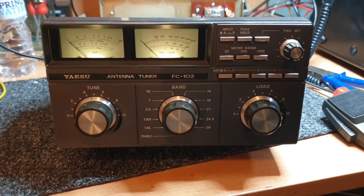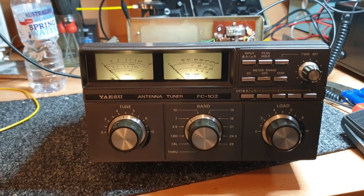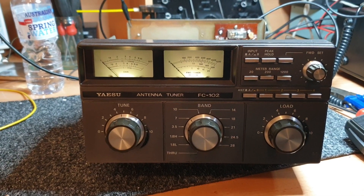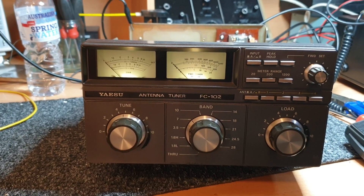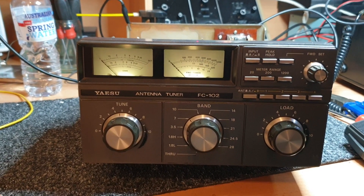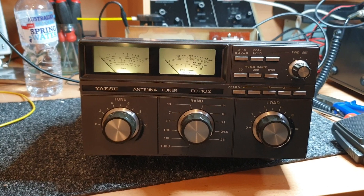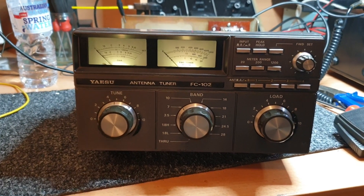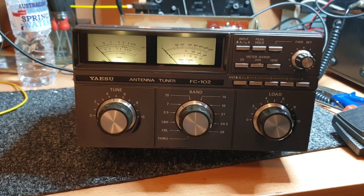If you compare it to something like the HF Auto Powerstar — what does a real antenna tuner look like? Well, it's a box that's about twice to three times the size of this box. And is bigger better? Yes, absolutely — you can get quite a bit more tuning range, though it still can't do the impossible. You'll find the FC-102, the FC-107, really all those Yaesu tuners that were in this size box — to be honest, even the FC-902s and the FC-101s, a little bit smaller box — they kind of all did the same thing. They all had that ability to touch up the SWR.